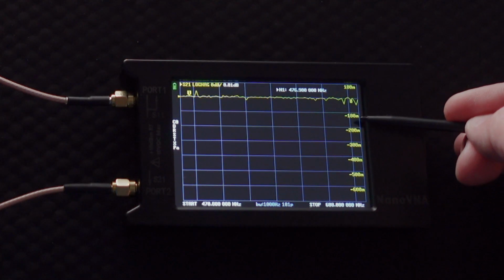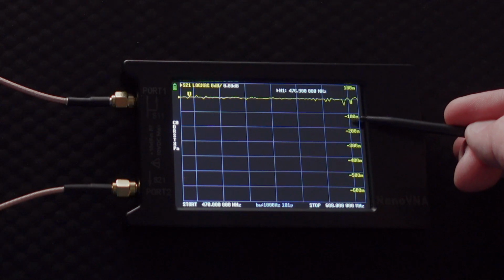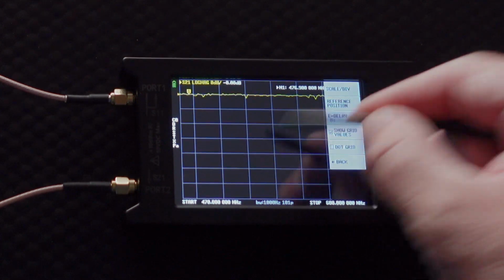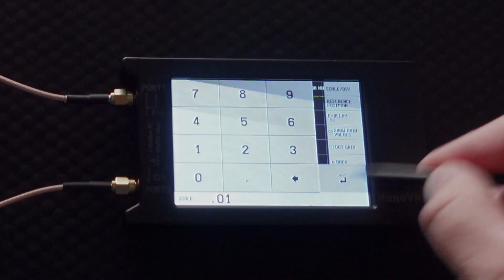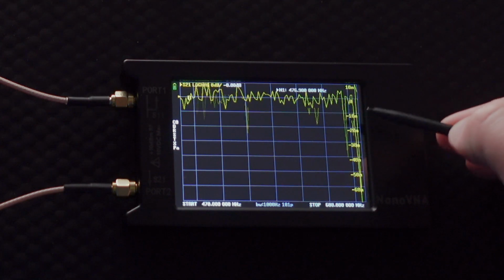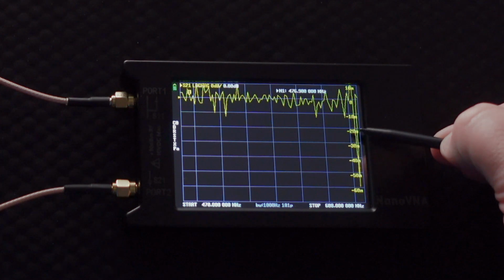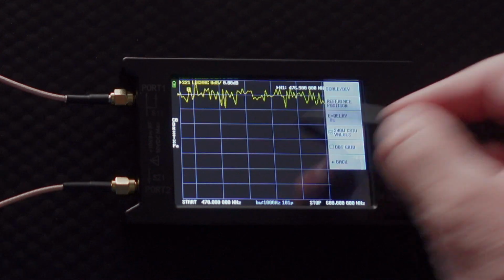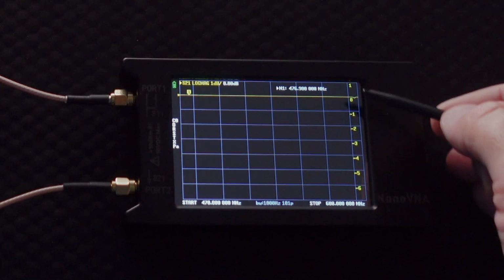So now this is negative 100 millidecibels, I guess you could say. And it shows that there's a little bit more actual to that line. So if I go to negative 0.1 and really zoom in, that shows that there's actually some activity happening there. But when you zoom that far in, this is like 1/100th of a decibel. That's 2/100ths of a decibel, 3/100ths of a decibel. You can see that it's bouncing around, and this is perfectly acceptable. That's just to show you the zoom-in powers. Now I'm going to go back to 1 for right now.